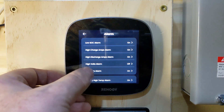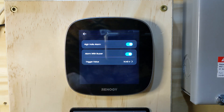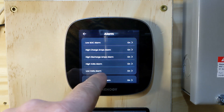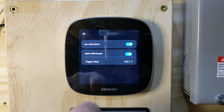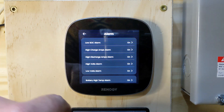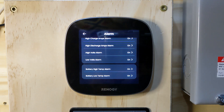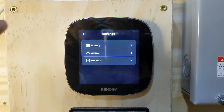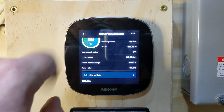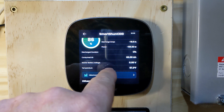We've got a high volts alarm set at 14.4 volts, which looks good. The low volts alarm is set to 11.2 volts — that's where the inverter stops functioning, so the alarm will alert me at that point. We also have battery high temp and battery low temp alarms. If you have one of these units you could figure out those settings on your own, but I'm happy to do an additional video if you have questions. I'm trying to keep these videos a bit shorter.